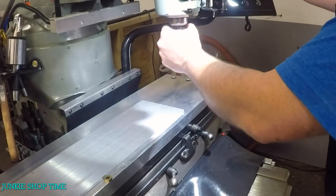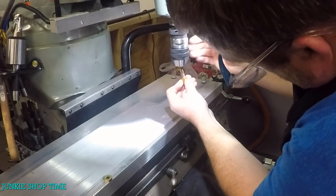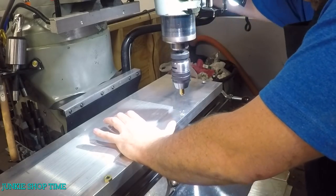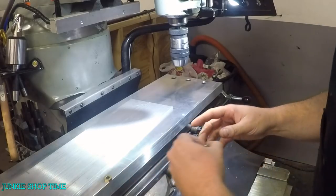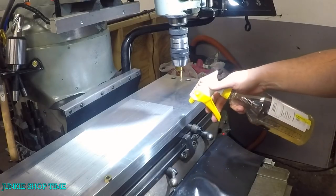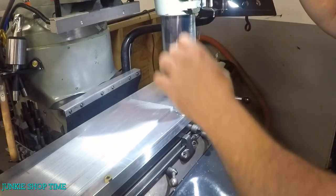There's 750 - short drill bits are the shit. Blow that off. Now what we've got to do is put the machine in low - check, we're in low - and then come in and just countersink this hole real quick. So we got that countersunk. Now what I'm doing is putting the tap in and I'm going to try to power tap this. You don't have the quill lock on - you put it in low range and just let it go down.